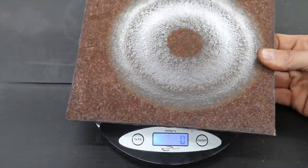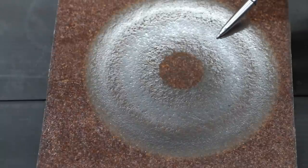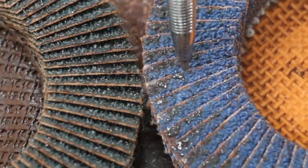The Diablo started off at 993 grams and is down to 984, a loss of 9 grams. The Diablo actually did a pretty good job on the second test — it started to cut through the rust scale but the test ended before it could make much progress. Comparing the Walter wheel and the Diablo, a closer look shows that the amount of wear and tear is about the same.